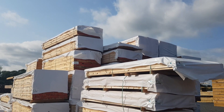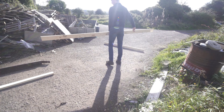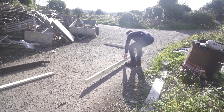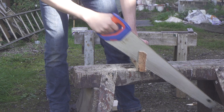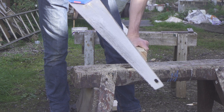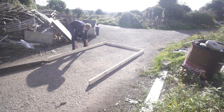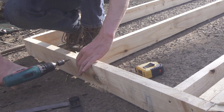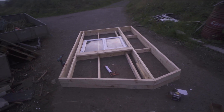With the trailer chassis completed, it was time to move on to framing the tiny house. The whole building is framed with 4-inch by 1.5-inch, or 100mm by 35mm, lumber. This offers significant weight savings over a traditional 2x4 while still allowing a 4-inch cavity for insulation with minimal losses in strength. Because of the sheer size of the long walls, I decided to frame the building in sections and assemble it piece by piece.